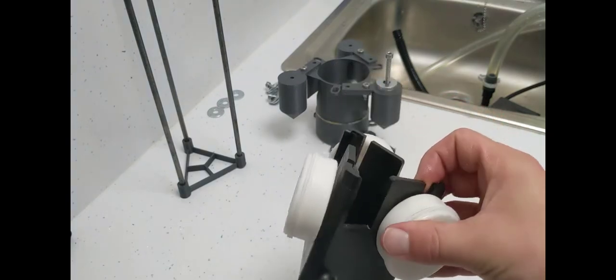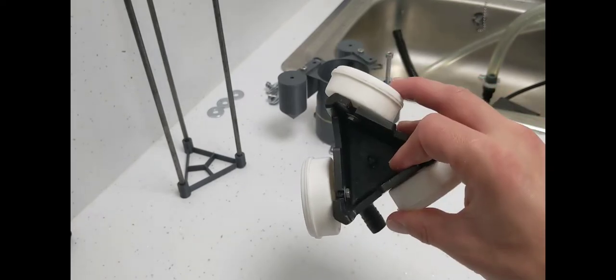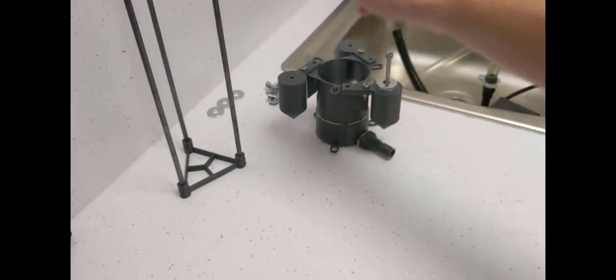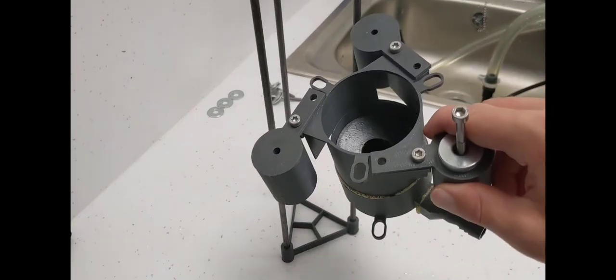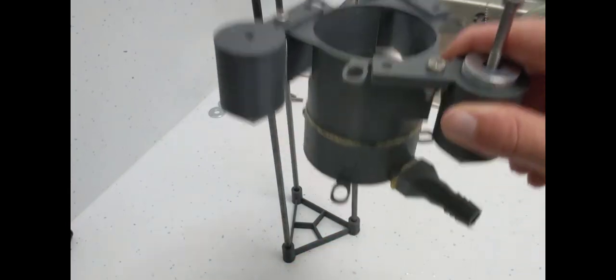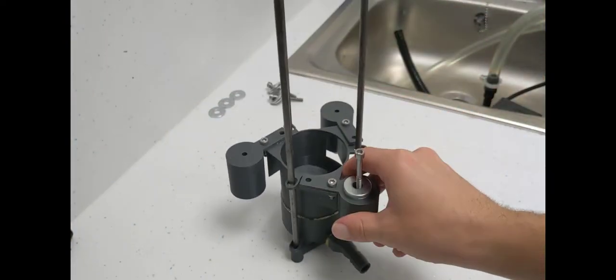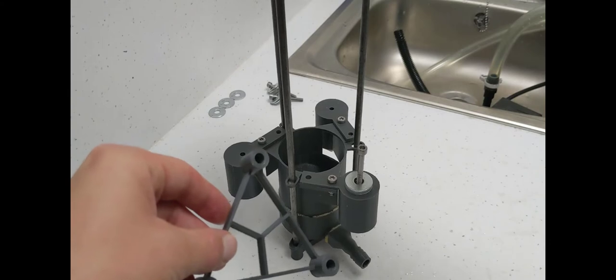So that's the existing design. What I've done is try to solve all those problems. The most noticeable thing is this stand to the side — on the coolant skimmer itself it has little ovals that slide onto the rods. If I get them lined up, it just goes up and down, and another piece goes on the top of the rods so everything is held rock solid.